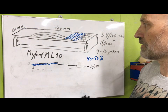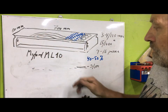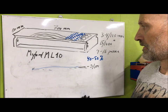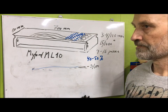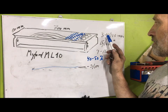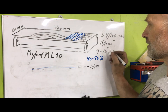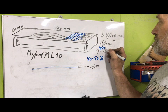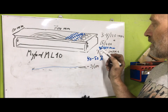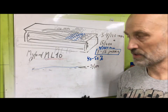Roughing doesn't matter, just get rid of this so that you get down one way or another to the lowest area. And I'd like to be able to calculate, so by knowing that I'm 3 to 4 out, knowing the normal, let's say, 4 thousandths of a millimeter deep cut I take, then I can also calculate how many passes and how much time, how long it takes.